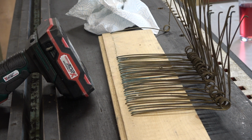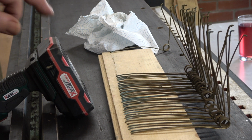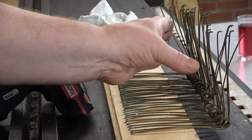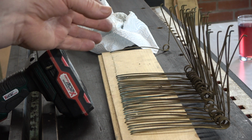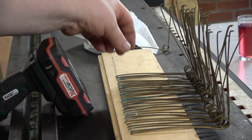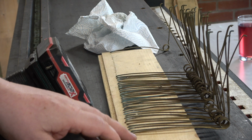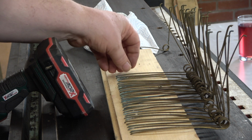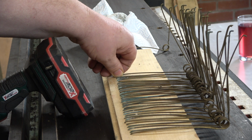But what I've observed, and why the camera's on this angle, is that the next spring I'm about to put in isn't as strong as the rest. They're more or less all about the same kind of strength. Now, you don't want these so strong that the organ is very heavy to play, because these are the springs that you're fighting as you're also fighting air pressure. So I took these all out and put them in this piece of wood which I'd made, drilled these holes in so that we didn't get them wrong. So they're all going back where they came out, but I'm going to strengthen this one up a little bit.